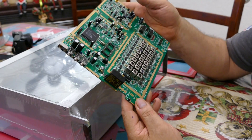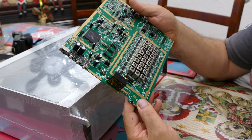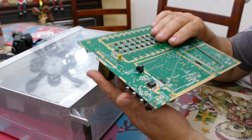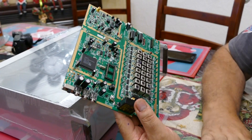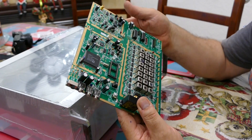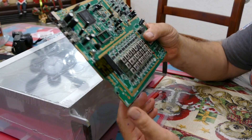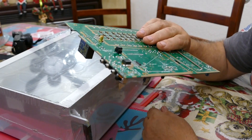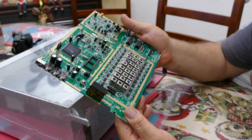To build something like this, of this kind of scale, on a homemade circuit board is not a good idea — I certainly wouldn't recommend it. I've built many homemade boards through the years and I noticed that ten years later the boards were all corroded. It's just not worth it. You wouldn't go to all this trouble of building something like this on a homemade board and then have the tracks corroding off on you over the next dozen or so years.